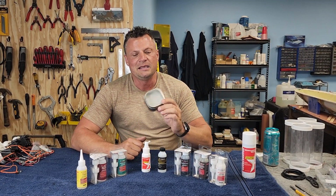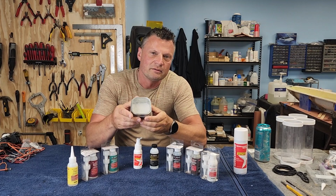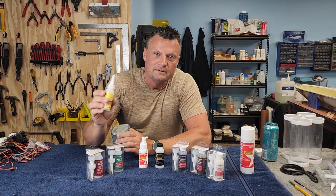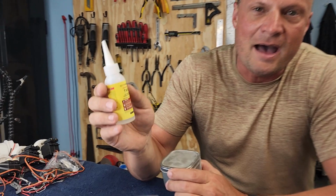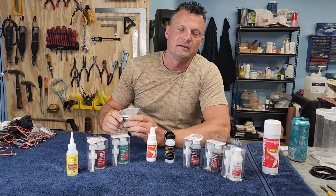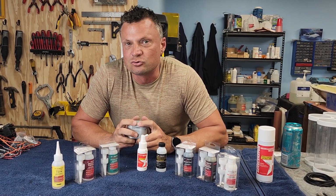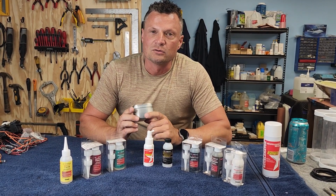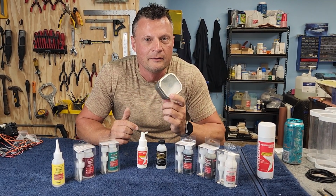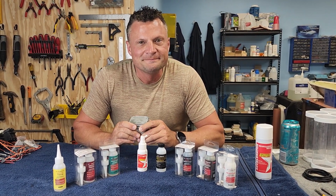Baking soda. I keep a little can of this beside my workbench, and basically all you do is drop a little whiff of this into the crack or void, smooth it over, and then you bust out your thin cyanoacrylate, and what ends up happening is the entire mess kicks off instantaneously and creates something somewhat akin to concrete that is exceptionally hard, easy to sand, you can drill it, and you can tap it. So if you're looking for another way to accelerate a joint or to do a large void fill, baking soda is exactly what you're after. Keep it by your bench, it's worthwhile.